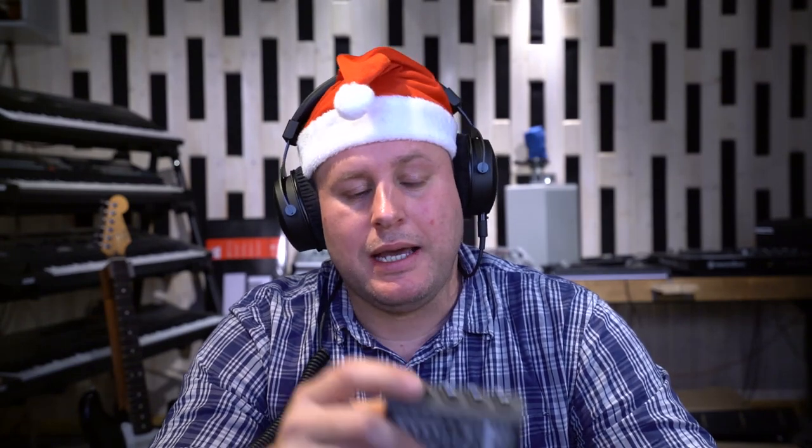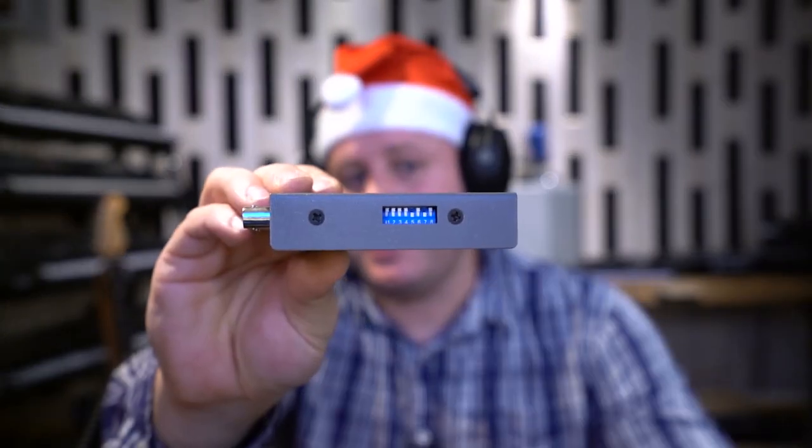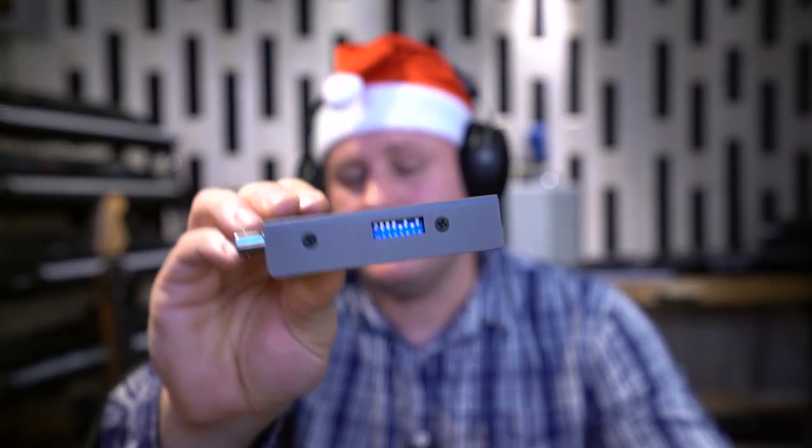Maybe you get confused when I say you can insert digital or analog audio, because we don't see here any AES/EBU or any optical or S/PDIF digital audio inputs. They utilized the 6.3mm jack input as an analog balanced input or balanced AES/EBU input. And on the side where you see these dip switches, you can choose between the two protocols. But what you cannot do with this, you cannot mix these two audio protocols together.